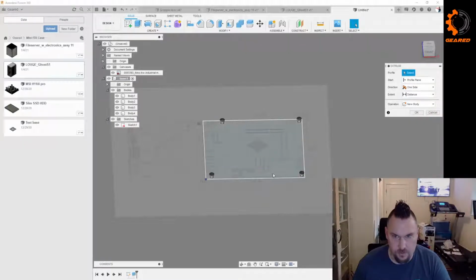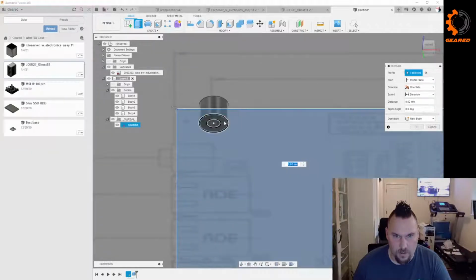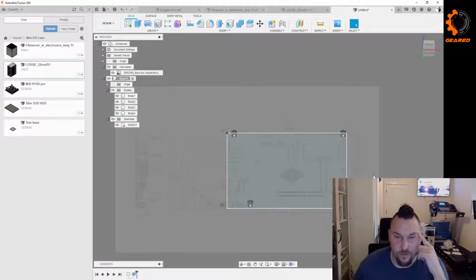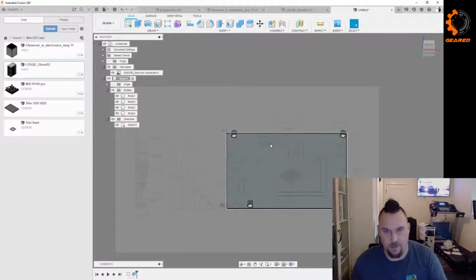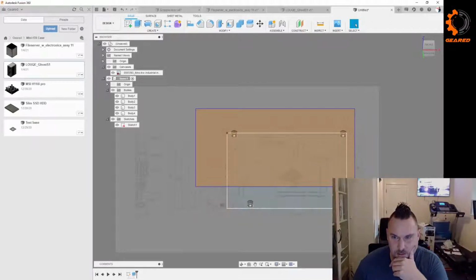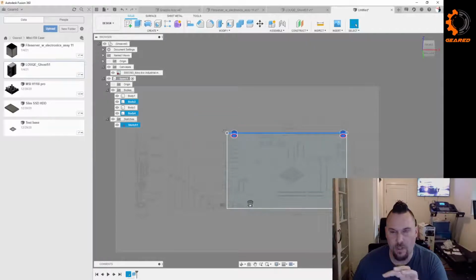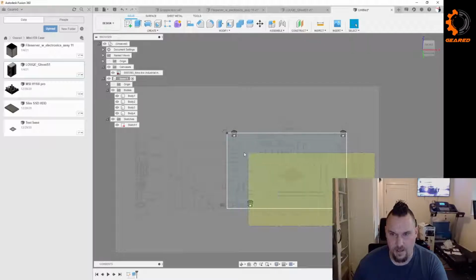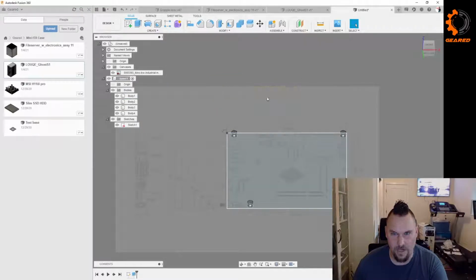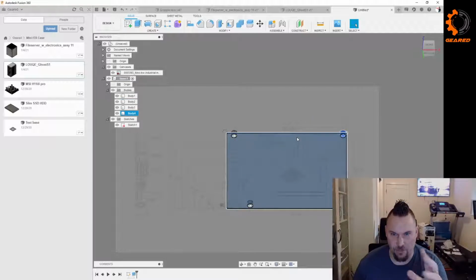Because, turn the sketch back on, extrude this guy with all the parts. Oh, here's a cool trick I learned from Brad. So when you do that's not what I want though. If I go to select and say window select, there are 2 types of window select. If you go this way, it pulls in only the full line that you're touching. Escape out of that. If you pull the window this way, it catches everything that's being touched. If you notice, when you highlight, it's a different color window, depending if you're going right to left or left to right. So this way pulls in just partial stuff. This way pulls in everything related to what's touching it.